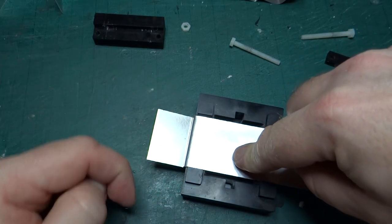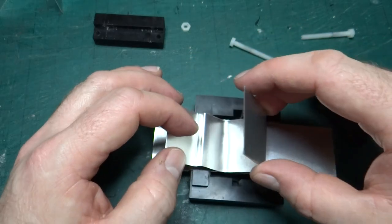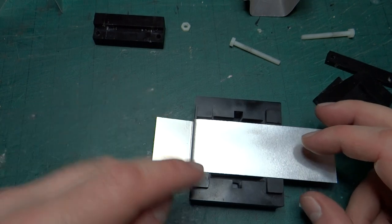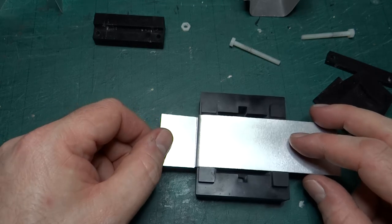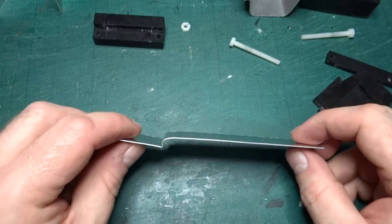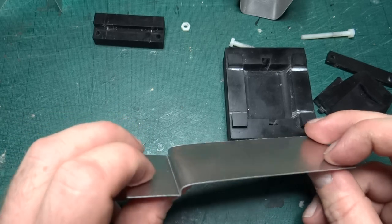So if I just elongate this block slightly, I'm not quite sure how much I'd have to elongate it by. Probably not very much, actually. That's not obviously too far off. I'll have to do some measuring and see how it works out, but I can probably measure what that distance should be on the 3D model, and then work out how much I need to change that. So that's good. That'll be the next step, I think. I'll see if I can refine that original form tool so I can position it. But yeah, I think we're getting there.